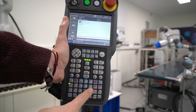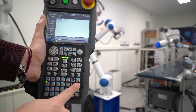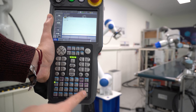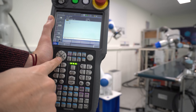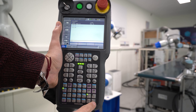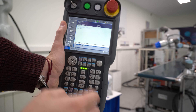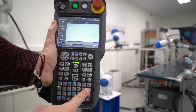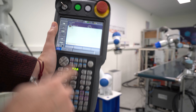Let's try that again. We go into the position, press the forward key — remember, servo ready and then deadman switch, forward — and then enter. So what happens if you haven't moved into that position? Let's try with the last point. If we press delete and then enter, an error will pop up and it will tell you to move the robot to that position, which is a bit different because later we'll show you how to select in bulk and delete without needing to be in that position.